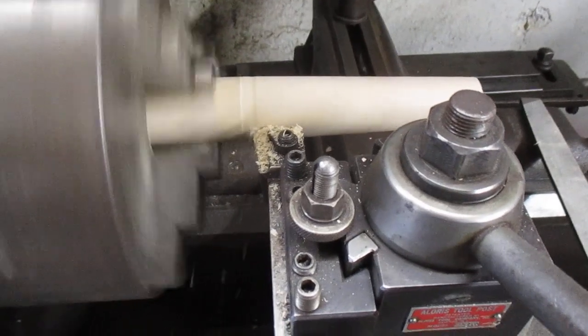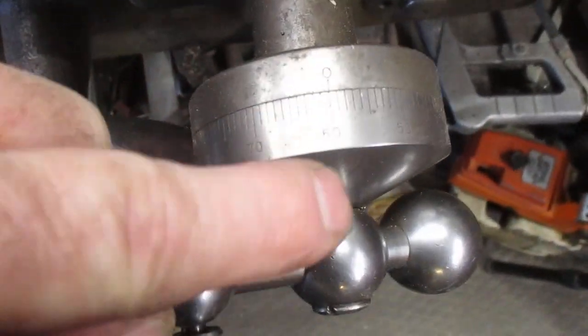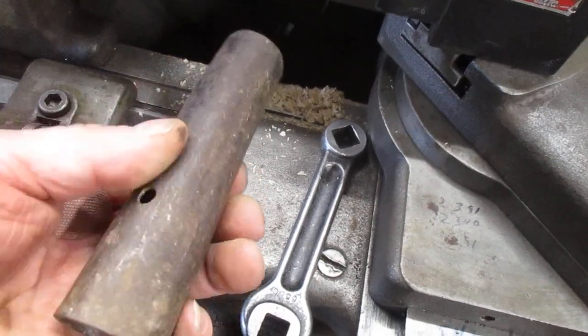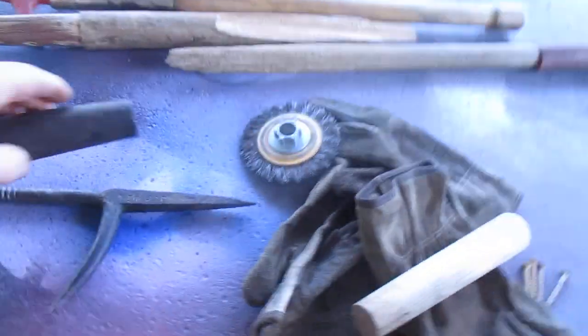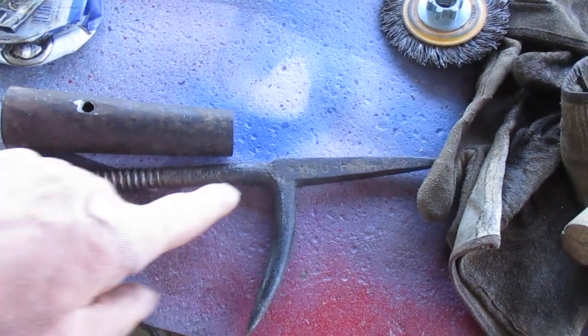Then we'll see how it fits. I'm on 60 on my dial - you can't really read it on screen. This thing isn't perfectly round so if I get it close I'll just hammer it in. But then I've got to figure the timing of this hole here - this is supposed to just screw in. I drilled a hole in it and I want to screw that in and then re-pin it, so I've got to figure out the direction of that. Put a timing mark on there, screw it in, and then drill accordingly.